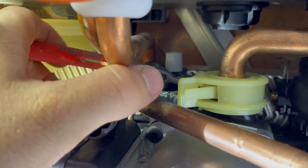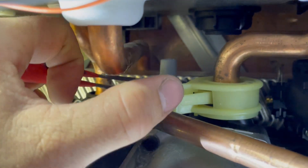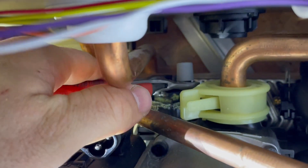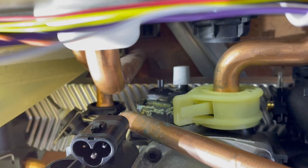Once you're happy it's finished, get your grips as best you can onto the air vent and twist. You will hear a hiss — that's just the rest of the water coming out. Make sure that you do leave the drain off open. You may need to get a flat screwdriver in there just to prise it out. Be very careful when you do.